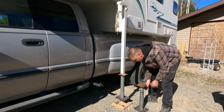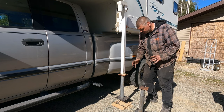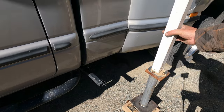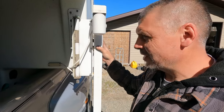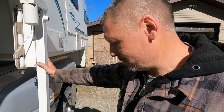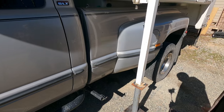So I bolted that one in place. I got two built now — there's the second one. The two bolts that I welded in are on the side here, and I actually drilled it for a third bolt on the outside to give it a little bit more rigidity. We're up there — that's an 18-inch spacer and I figure that's about what we need to get her on the big truck. I may put a bar across between the two fronts because these are swing-out brackets so they're kind of flexy. They're not the most confidence-inspiring thing when you're lifting it up high. I had to see how high it would go and to get it that high I put the truck right under it — it freaked me out, and now I've got to go 20 inches higher. I might devise some sort of crossbar to go across between the two just to give them a little bit more rigidity, maybe square tubing or something. We'll lift it and see how it goes.